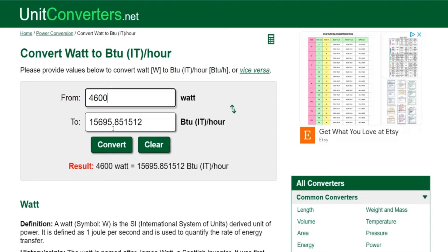If we go up to a 10KW heat kit — doubling the 4,600W to 9,200W — that gives us 31,391 BTU/hr. At that point we're above 2.5 tons, so if the heat kit comes on, it's actually going to be heating the house somewhat, providing roughly 10,000 to 15,000 BTUs of net heating.